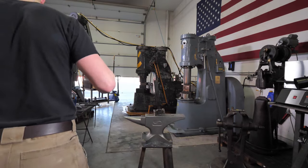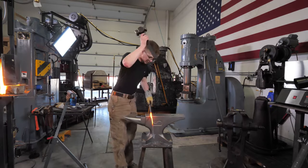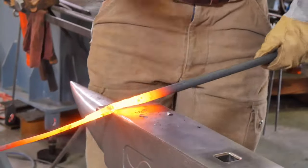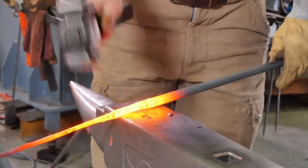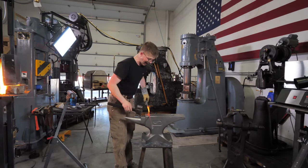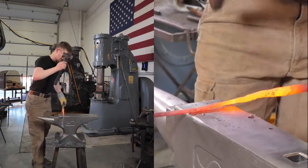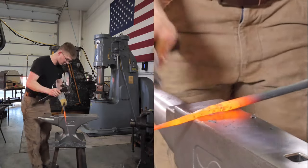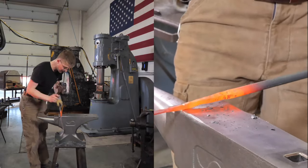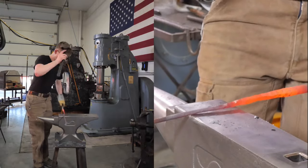Well, I took out the top piston ring. It didn't make it into the video, but when I was grinding the weld on the top of the ram, I thought it was fine. You know, I'd make a little dust, I'd clean it up. Well, invariably, I made a lot of dust, and I had to do a lot more cleaning up than I would have liked to do. I actually had to pull the ram all the way up to the point that I got the piston ring out so that I could clean all of that and make sure both the ram and the cylinder were entirely clean. And so I have taken that piston ring out, and I will say, it felt like it was an awfully good fit, so I'm not particularly worried about the piston ring fit up.